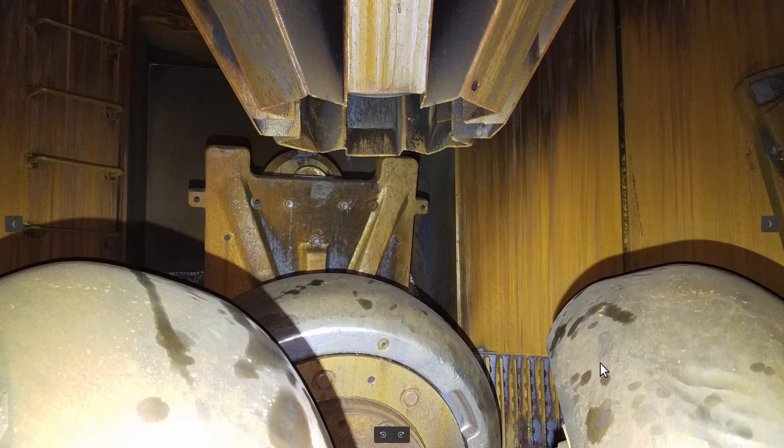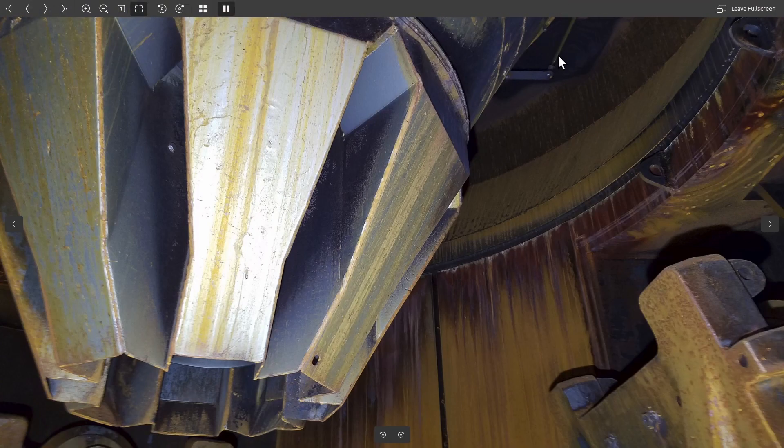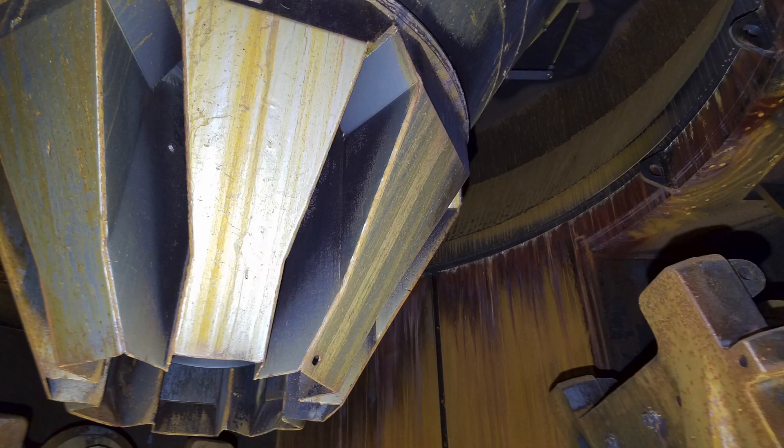These are the three rollers inside. You can see a little bit of wear on them. These are oil-filled bearings in the newer style — pins go through here on the back side, and a spring outside puts some tension down on them, but they're free to move up and down. These stay stationary and the turntable rolls. You can also see the reject coal coming in and the classifiers up here — some of the linkages sit back up in here. They'll spin the coal-air mix and help determine the fineness.